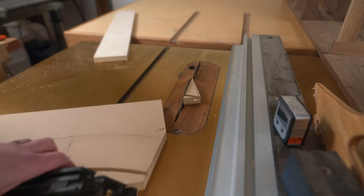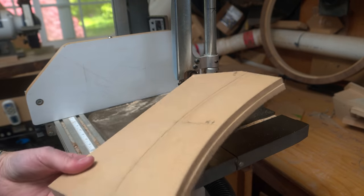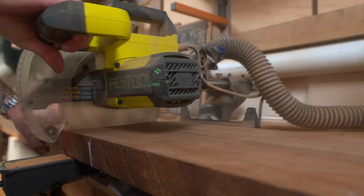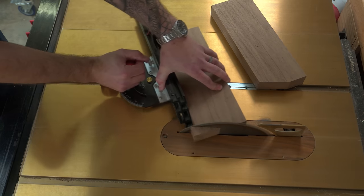That pie I've taken in four segments, 360 degrees by four is gonna be 45 degrees, but now we've got eight, so each one needs to be 22 and a half degrees. So I'm gonna mark that out so I can figure out what the overall length of these chunks are gonna need to be in the rough.